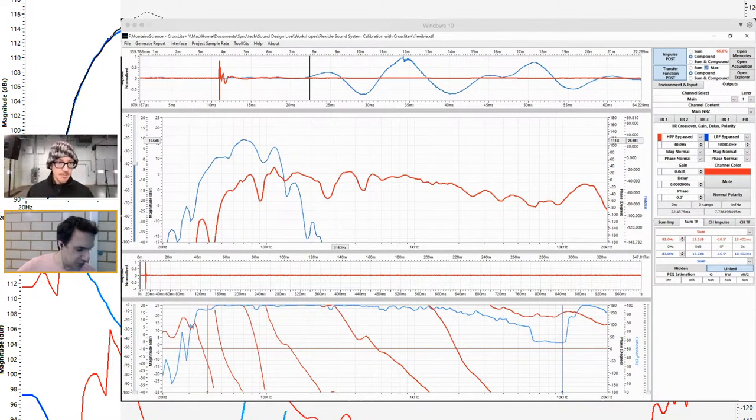Yes, I saw questions about these excitation patterns, signals. Of course, with log chirps, as you can see, we have better signal-to-noise ratio. So it's easy to see in the coherence trace, coherence going up. So using long log chirps, we have better results, increasing signal-to-noise ratio. But of course, when we use this kind of signal, we are reaching a steady state.